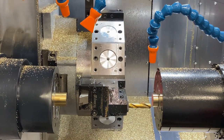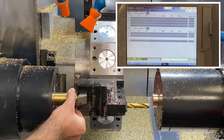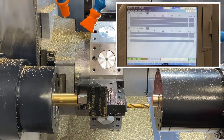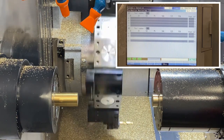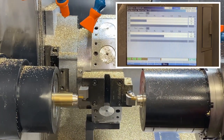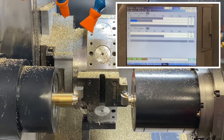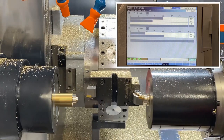Tool load monitoring provides a way to forecast tool change intervals and help mitigate the chances of tool failure producing bad parts, damaging other tools, or even the machine. The load monitoring function samples and keeps track of servo torque on user-defined axes during the cutting process. Once a cutting process has been proven out and stabilized, load monitoring can be initialized by establishing a baseline load reading. This process is called sampling.